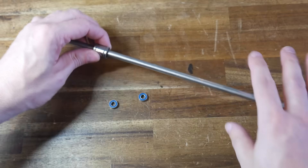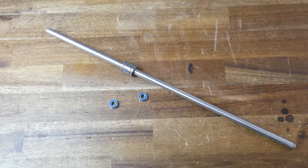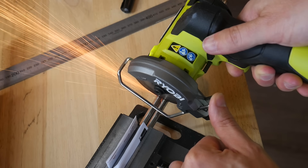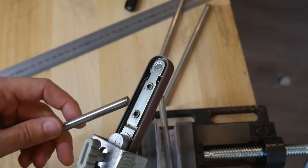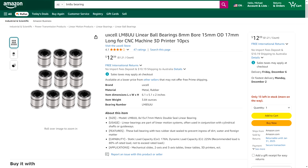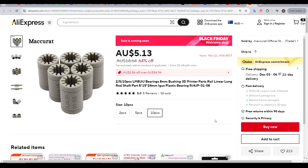Version 3 was successful, so I'll cover the build in detail so you can follow along at home. The big change for version 3 is the use of linear rods and bearings — these ones are left over from my old Solidoodle 2. This pair is 350mm long, so I simply measured the middle, cut them in half, and cleaned up the ends, giving me four rods at 175mm. They ended up being a fraction short — maybe 200mm would be best. I'm using shorter LM8 bearings, but the longer ones will fit too. These components are heavy, and I'm pretty sure you could substitute in 8mm carbon tube and some plastic bushings if you so desired.